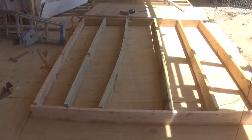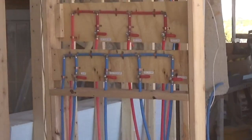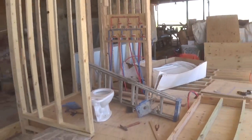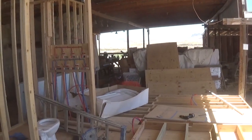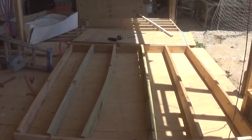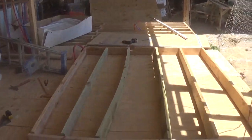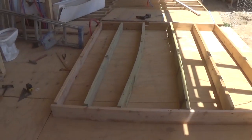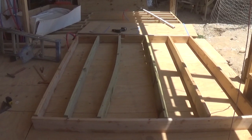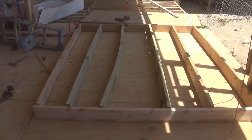Now this wall — it's a two-by-six wall, and it has to be two-by-six because when you go up here and look at that wall with my PEX manifold built into it, in order to put the PEX manifold in, I needed the width of a two-by-six. There'll be a doorway right next to that, just to the right of the manifold. If I had put a two-by-four wall there, it would have looked funny. The ones I had set aside for a refund — which they're not giving me — I had to use them because I didn't have enough eight-foot two-by-sixes.